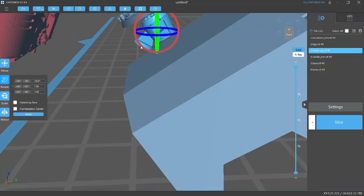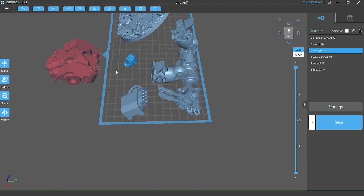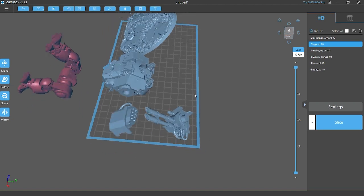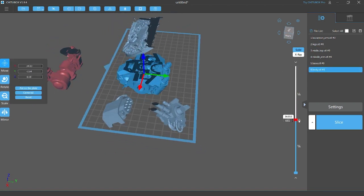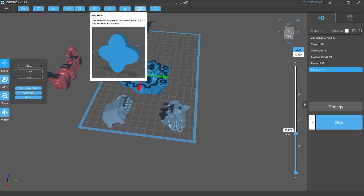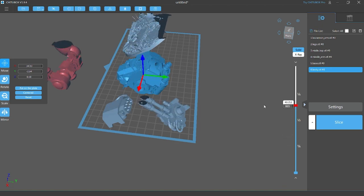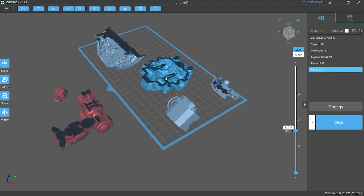These little pieces — you're going to be using small supports, so it's still important to get orientation right. Even medium-sized supports on small detailed pieces can pull the detailing off. Moving to this big piece — this one is already pre-hollowed, and that's going to be very important with bigger pieces, not just to save resin but to reduce the weight to something more manageable.